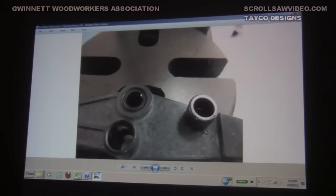The smaller bearings are about two dollars and the larger ones are three dollars. I had difficulty finding that one sealed bearing, but since it's sealed, it's not likely to need replacement as often. I got on good terms with VXB — they're very responsive and accommodating. My neighbor across the street told me how to replace bearings in an assembly like this: you just stick one bearing on top of the other and press it — the old bearing comes out the bottom. When you've got a double-race bearing, you use a small punch, get hold of the edge, press the lower bearing out from the top, turn the part over, and repeat. Then press new ones in.